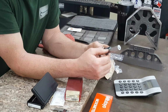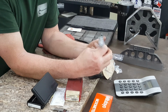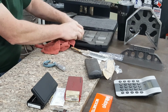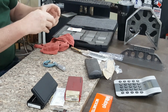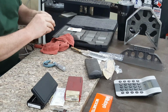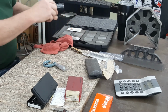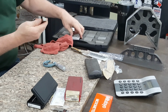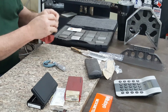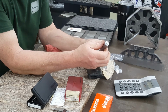Yeah, this one here, I'm getting 9/10 over on that one. So that's kind of cool to just see what the tolerance is. That's not what I even thought about doing when I started this video. I was just wanting to kind of compare 3 mics and see if they were all reading the same as that brand new one, and they are. I don't even know which one I checked the first time, but probably wasn't this one. So we've got 7/10 over 500 and 9/10. Now let's see what this one measures.